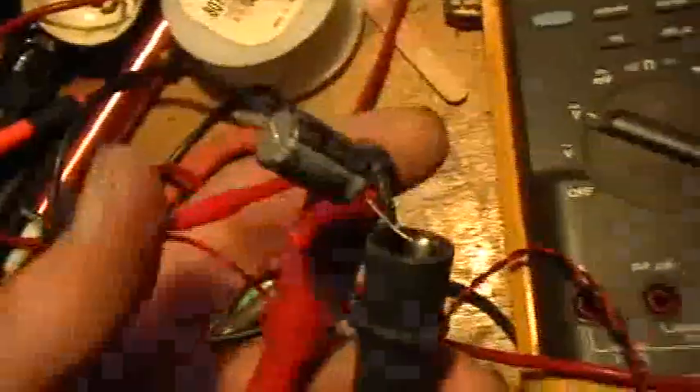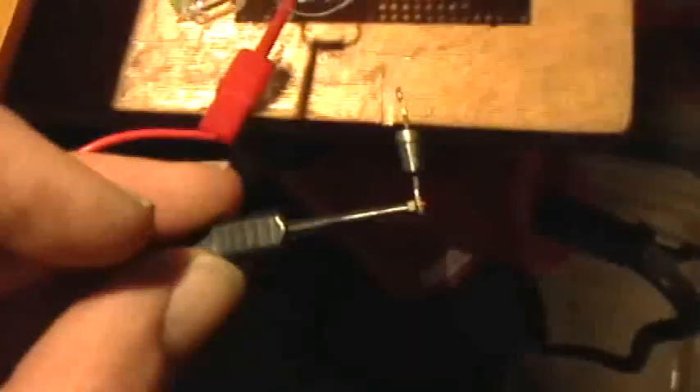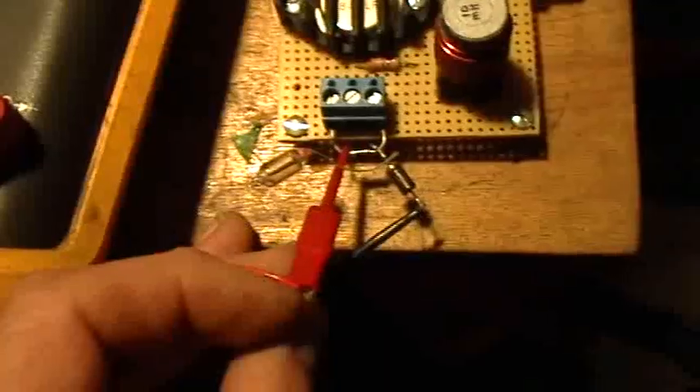I have this other little set of clip leads that go over to the output of the neon Joule Thief. The positive lead goes to the positive side of the electrolytic capacitor and the positive side of the voltmeter, and is clipped to the cathode of that little rectifier diode. I have another little rectifier diode pulled out of an old television set — an 800 volt, 0.8 amp diode — and I'm going to use it to make the connection, so we've got the capacitor and diode substituting for the neon light.